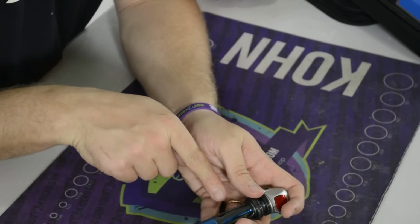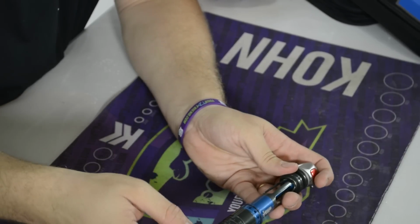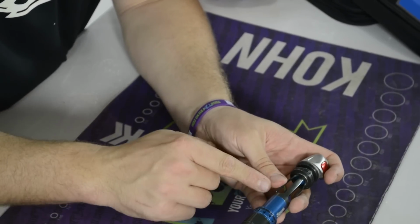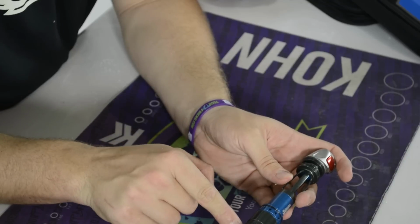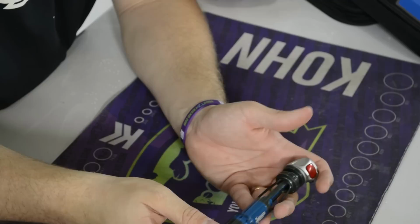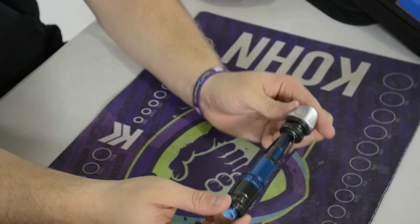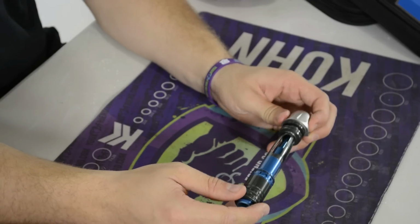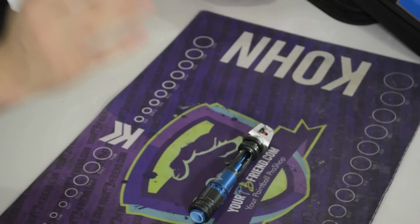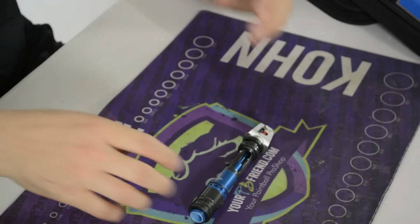So now this air chamber is locked, and the air starts pushing through this area and through the inside of the bolt. Then at the proper time, it reroutes the air, pushes the bolt back, seals off this chamber so that no more air can be dumped, and opens up the chamber to refill with the constant pressure. This is a classic spool valve design. A spool valve pretty much uses the balance of air on one side or the other, pushing on two surfaces. When it releases here, it shoots forward. When it drains this and pushes here, it releases back.